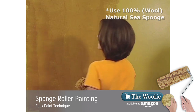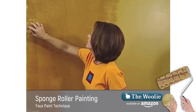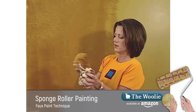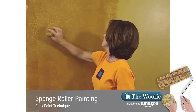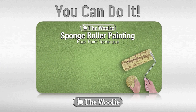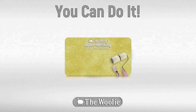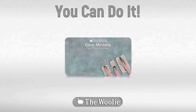Now I have my sponge, and I'm ready to begin removing the glaze and cutting into it to create my look. So I begin tapping, and I have a cotton cloth here, and I'm going to use that to actually blot off any extra glaze that I get on my sponge. I just begin pouncing on the surface. When it looks like I've got too much glaze on here, I'll remove it on the cotton cloth and begin pouncing again. This is a very subtle technique, but it is very beautiful. It just doesn't get any easier than this.